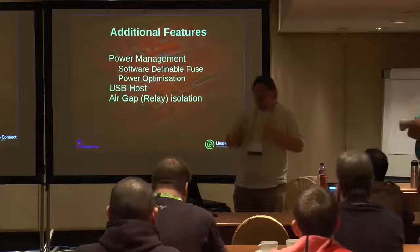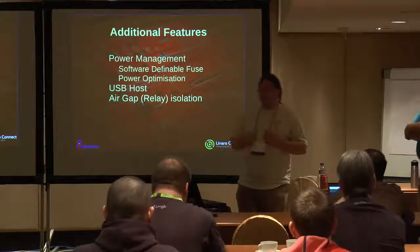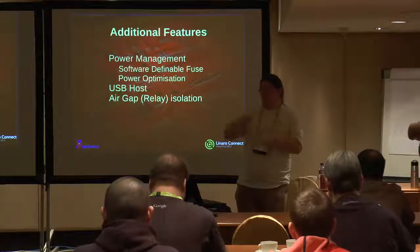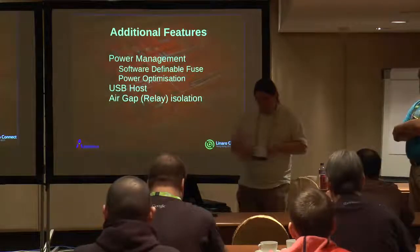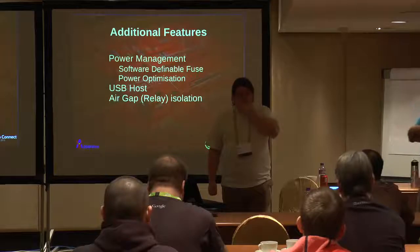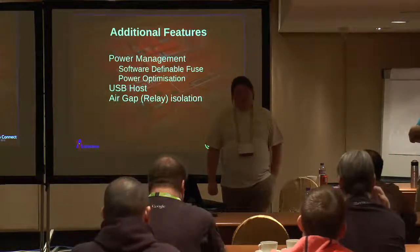Okay, it's not great. I'm not instrumenting each individual line of the PMIC on my EUT. I'm just looking at what the PMIC's got. But if you want to do some basic power optimization, we could rerun multiple tests with code running in different ways and actually determine, do I get away with this with an overall lower power consumption? If I actually start cross-building GCC or Clang or something, do we actually have a bigger power draw on the board? How much bigger does that get? Does it rise over time? Do you get problems with it actually starting to keep on pulling more and more power the more you use it?